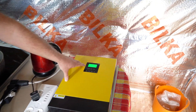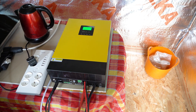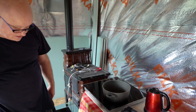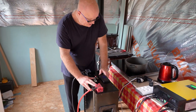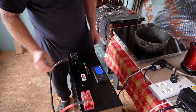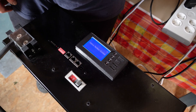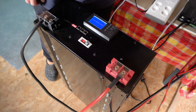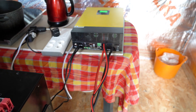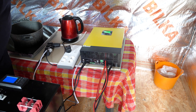Okay, so we go back inside. You can see the inverter's powered up here. All that's done is powered the inverter from the solar panels. I've got a pretty nifty piece of software I'm going to show you, but the next thing is to turn the battery on — we do that, then press this little button, and that's on. This uses a Seplos battery management system, which is a fairly standard one — you can Google that if you want to know what it is. Now we power the inverter on and that'll beep for a bit.